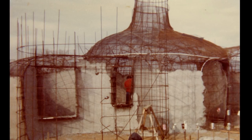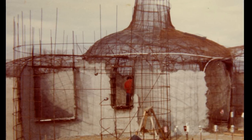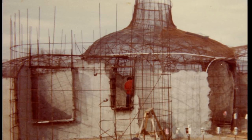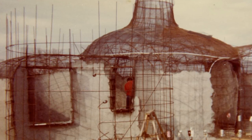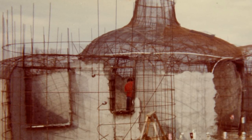On this first house, I want to note how much care went into the spacing of the rebar. You can see in the foreground this front structure really is on one-foot centers, and on the back on the dome it's less than a one-foot center. You can see there's rebar, remesh, hardware cloth. On this second house you can see there were some compromises in the one-foot center spacing — some places a little tighter, some places wider — but it still maintained the remesh, hardware cloth, and rebar formula.